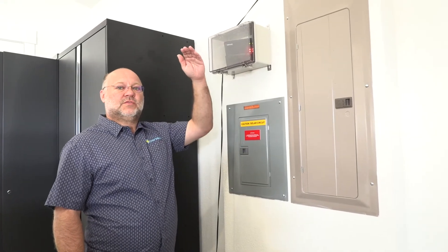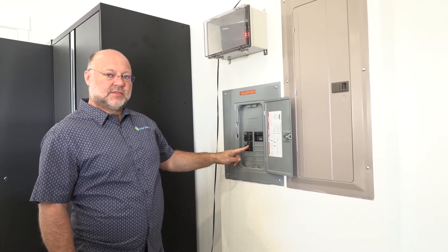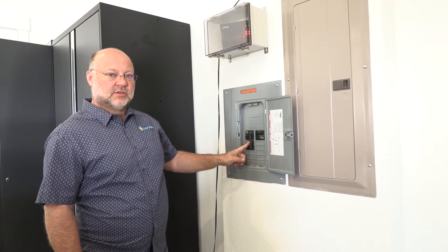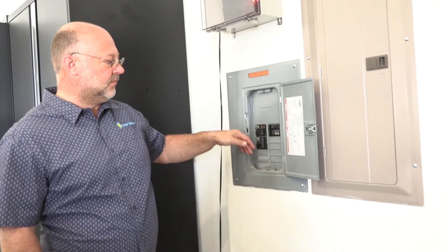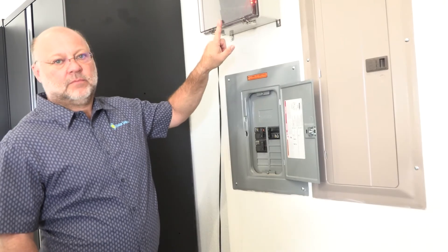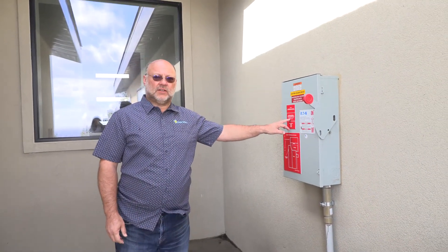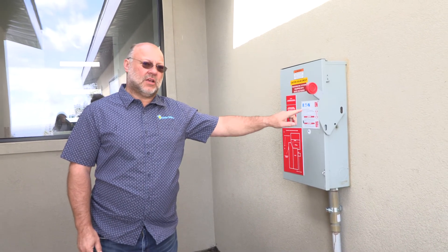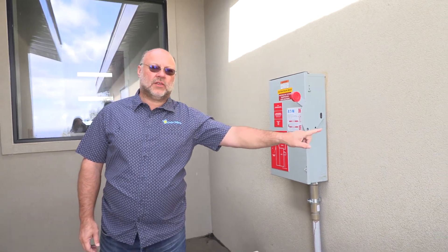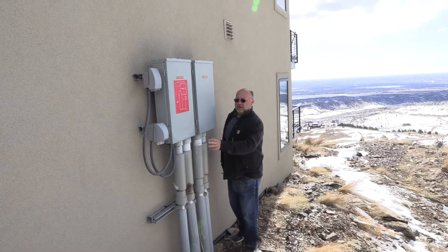The solar is up on this rooftop, comes behind the wall, and drops into this panel — 13 panels times three come down into a combiner box, times two, then those combined circuits go down into the equipment room. This 20-amp circuit powers my current Enphase Envoy, which will be replaced with the new equipment. On the other side of that solar sub-panel is my exterior disconnect. As mentioned, we're going to split this into two and add another switch, then run two circuits down into the basement service panels.